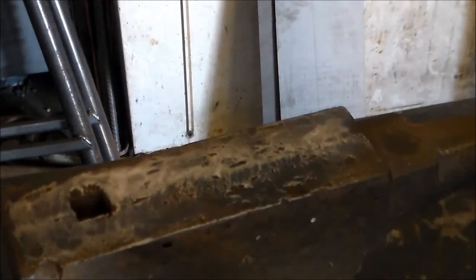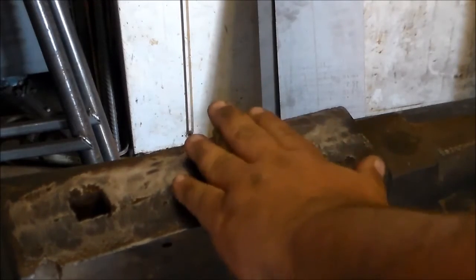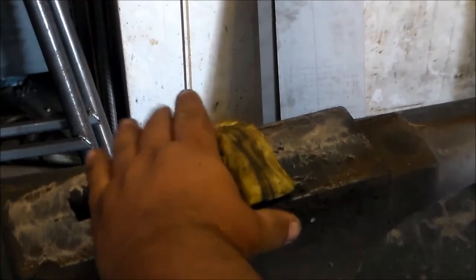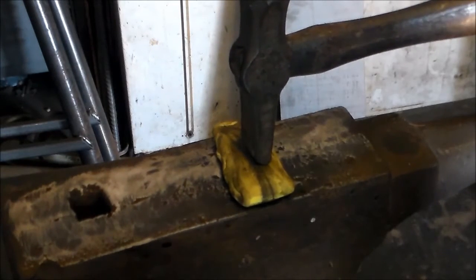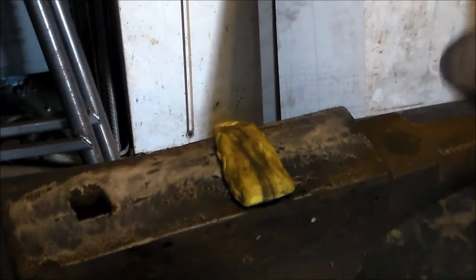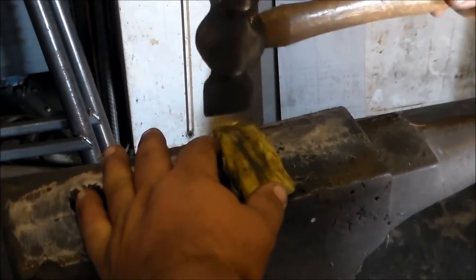The differences in the peens on the hammers — the reason why we have a straight peen and a diagonal peen — are how you're standing when you hit it. I use a cross peen the most of all. If I'm standing at my anvil where my belly is right here and I'm swinging the hammer, my arm has to come all the way out to the side to do it crossways, and I have to move my body to do it this way. With a straight peen, it's straight on to do this and I have to move it to the side to do this.